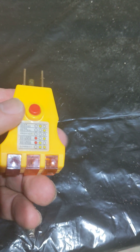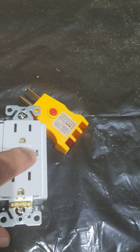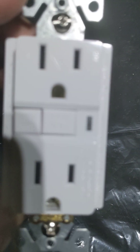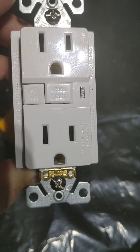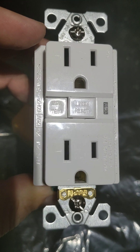At that point you go find the GFCI location. It'll usually be indicated as tripped — this little light here will be on, indicating that the circuit has tripped. You simply reset it by hitting that reset button right there, and then that light should go out and the outlet should start working again, with everything under the outlet protected.